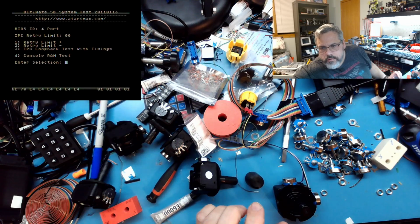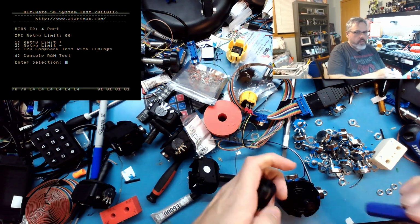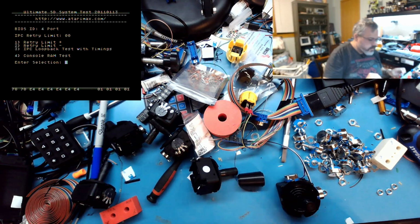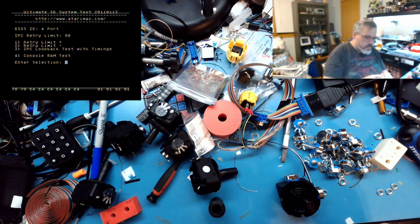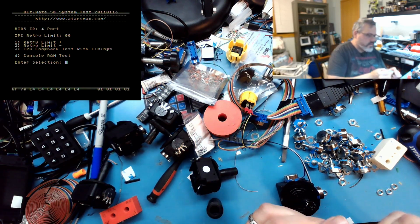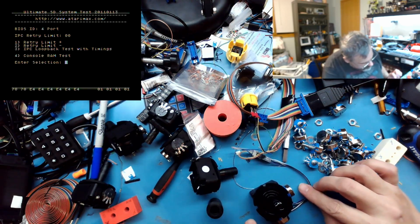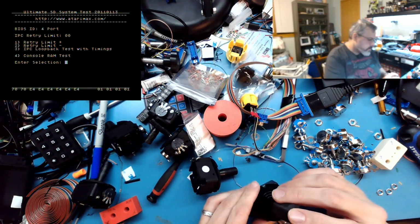So what I do is take, this is one of the 3D printed knobs. I use my deburring tool. Take a little off there. My next one, I'm going to print it with a little chamfer in the inside, but that is another day. This stuff is E6000, very strong adhesive, but this takes an entire day to set though. It's the only issue with it. And I always like to line up the seam towards the bottom.